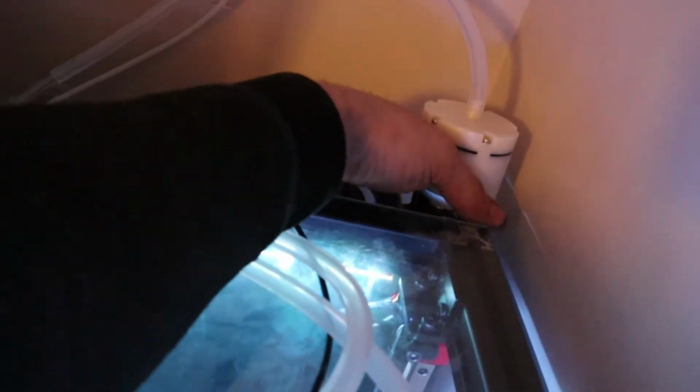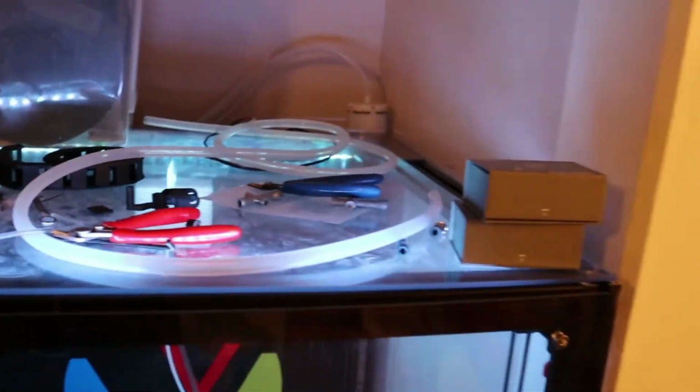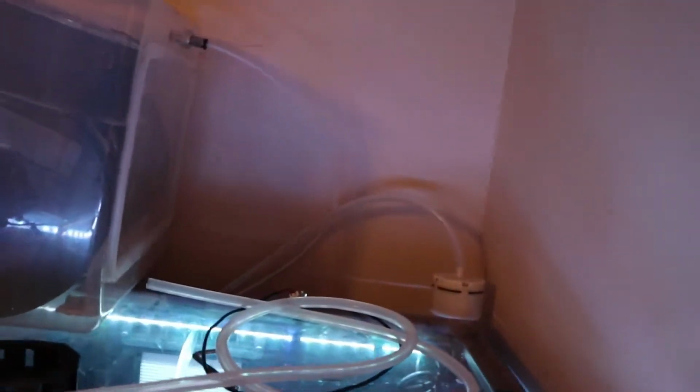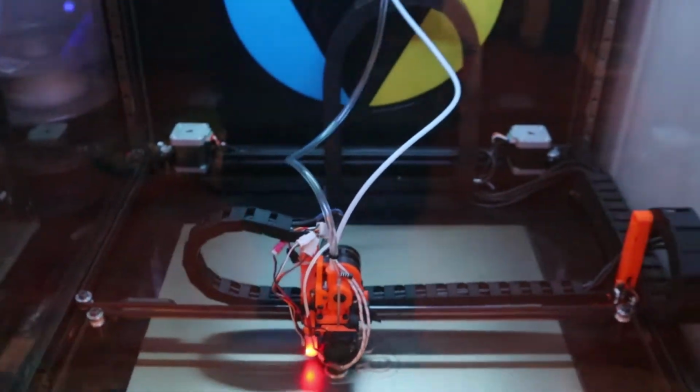Actually, it has a little piece on the back that keeps it, I can't lift it out. Oh, actually here. One thing with your Berd air is you should order 6mm tube to replace the thin stuff. I run the 6mm till it gets in here, then I use the stock tube. I only go to the small, very, very close to the front.